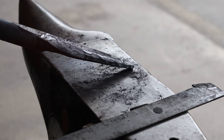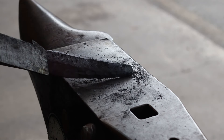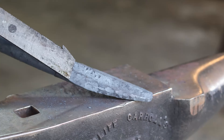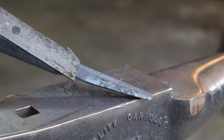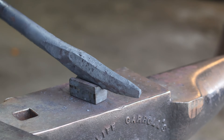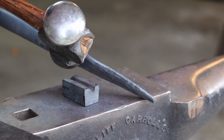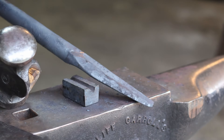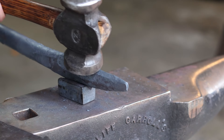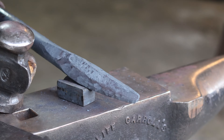I think that is going to do it for forging the actual shape here. We're going to refine this shape and take the banana shape out of it. Part of the way I'm going to do that is the next step in this process — using this V-swedge to set the drift into, in order to hammer down on this edge and preserve the other edge of the drift to forge that teardrop shape. I'm going to try to use this process to go ahead and straighten the drift back to its original shape.